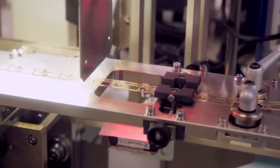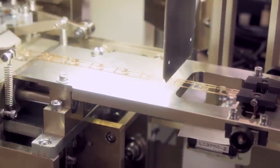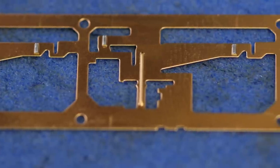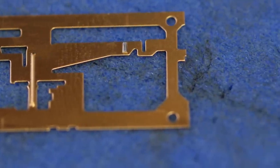And that entire machine's job is to put another entire set of these contact points on, which is something I didn't realize about Romer G switches. All switches will have a contact point, but like we just said, there's two sets on this one. So if you happen to get dust or some other type of material on one of the contact points causing it to fail, the other one could still work and you wouldn't even notice that there's anything wrong with your keyboard. So there's a redundant actuation.